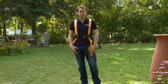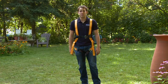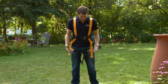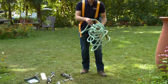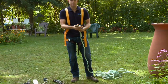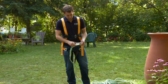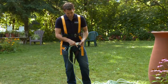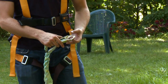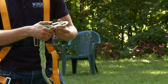When we're painting some third-story soffits or dormers sticking out of a roof, next we have our rope — a 50-foot cord. At the end of that we have a carabiner with a double-lock mechanism, so you can't actually open it unless you push on the back piece first, then open the front. This means wind, a bird, or bad weather won't damage the connection from the rope to the top of the home.